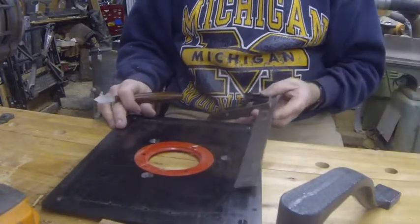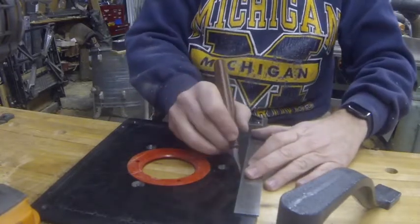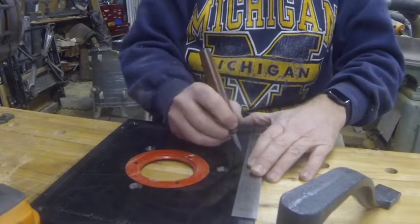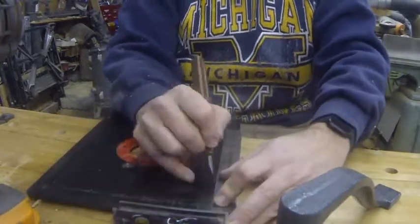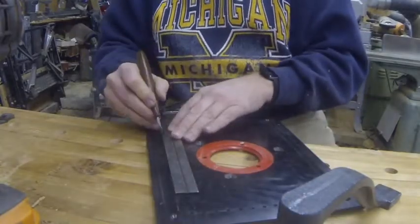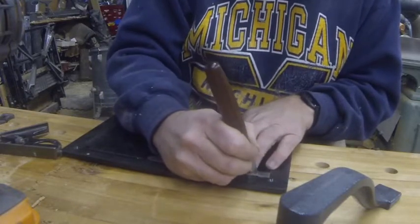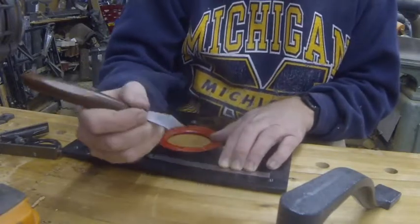Here I am making a router base modification to allow myself to make mortises on small and large objects. I am scratching into the base plate using a marking knife, then going to do half-inch markings for holes around the whole base plate.